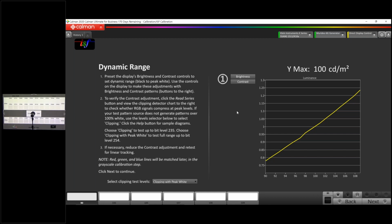If we were to leave the TV like this, let's say that later this afternoon I'm watching maybe Planet Earth, and it's one of the snow episodes or Antarctica episodes, or maybe I'm watching hockey or something. Those brighter levels of white are all going to be kind of green, and it's going to look really, really bad on screen. So that's something that we want to fix right away, and let's test the contrast theory to see if that's what's causing it.